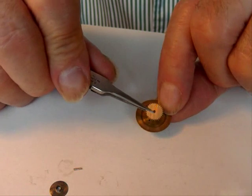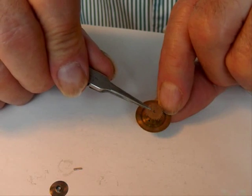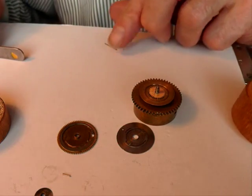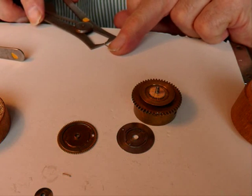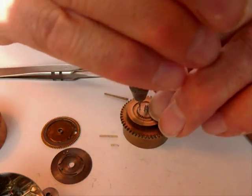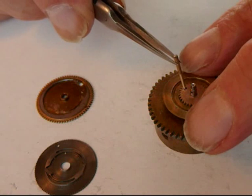Having selected your replacement wheel, you then have to break the hole out so that it sits down — still a tight fit — on the fusee. You don't enlarge the hole yet; the first job is simply to break the hole sufficiently for it to sit down against the fusee brass. The drill I'm using is a homemade spade drill; 0.5 millimeters is about right. I simply hold the drill in a pin vise with a spinner inserted into the opposite end to apply drilling pressure, supporting the fusee on an old clock mainspring barrel.